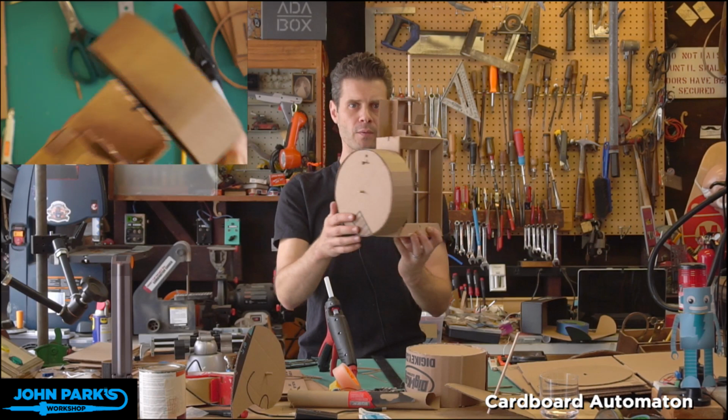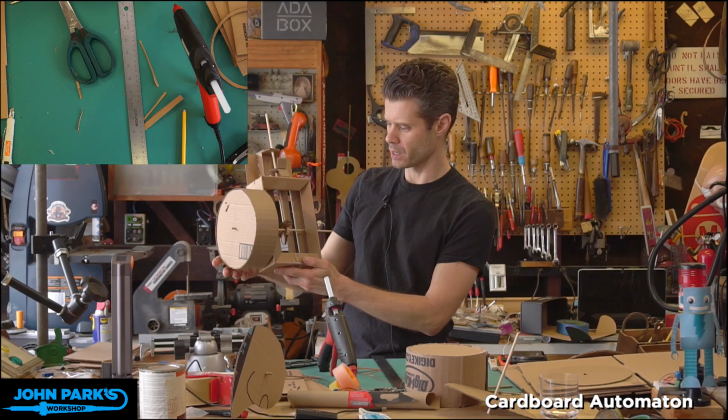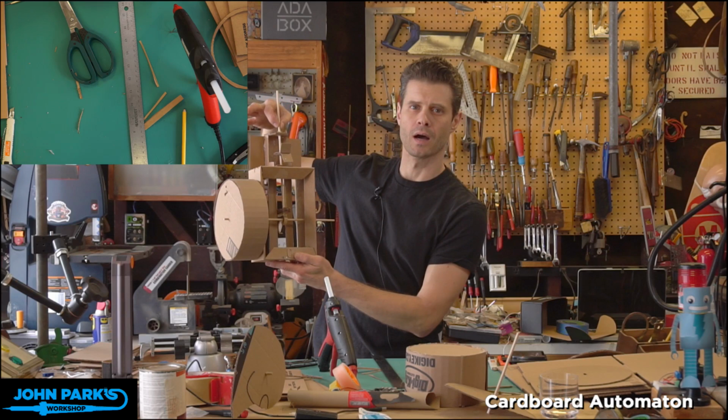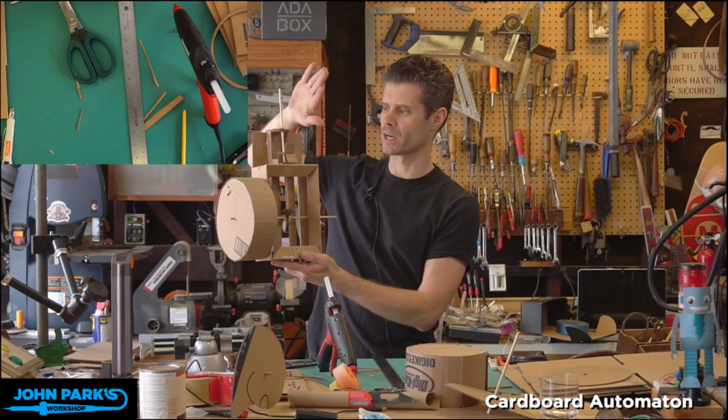And then the rest of what we've got going on here, you might have seen this on Show and Tell last night, or I've posted a couple things on the Adafruit social media. What we have is what's called a cam follower. So this shaft that can move up and down, that's what our automata, robot, character, bird that can flap its wings, whatever it is that you're going to want to move up and down. And it can be one piece of many in a mechanism.